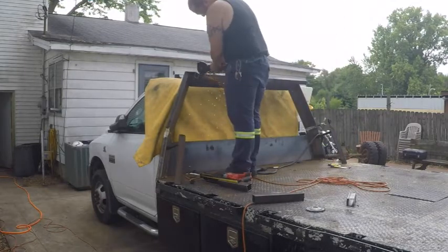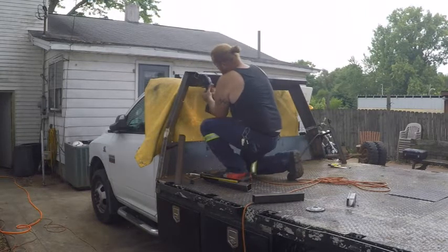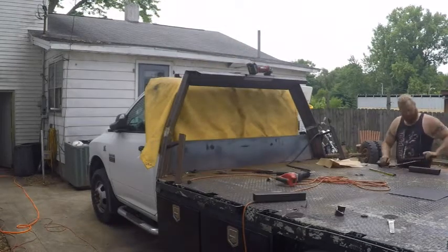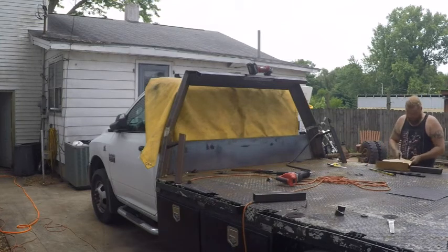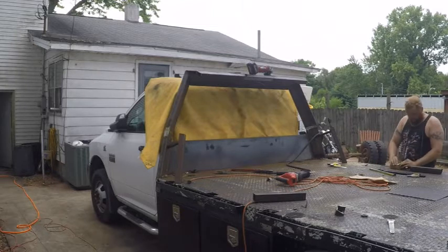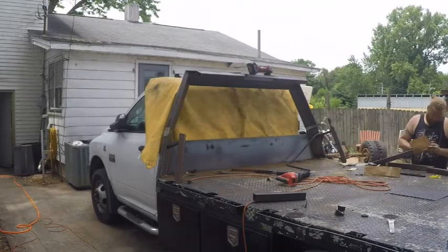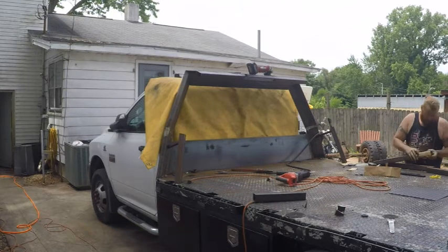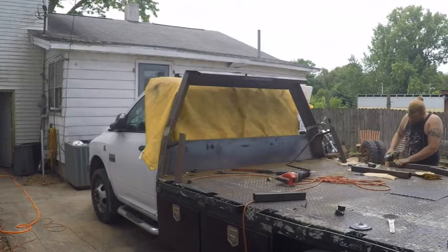Then I cut the angle I just marked into this top tube. And then I used paper patterns like we've been doing to transfer the miters from these short scrap tubes to the actual full-length tube that I'm going to put in their place. There's got to be an easier way, but this is what I came up with, and it worked.